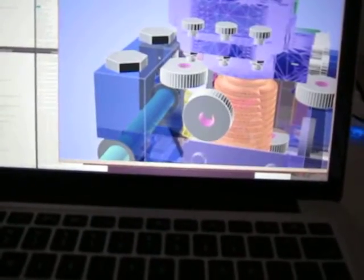I've also, because we've got 240 millimeters plus and minus, and this is 312, and that's about 50 or 60 wide. It's unbelievably tight. I haven't got time to change the frame for this version. So I've had to put a cutaway inside there to fit the edge of the bearing. Alright, and the belt will loop round that on there. So that happens on all 4 sides. That's to reduce the length of the belt that we need, because again I've got a 3 meter belt. It's been cut to 1.5 meters. That's what we've got, that's what we use.